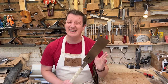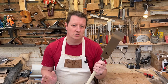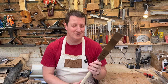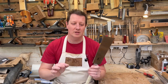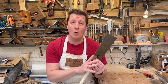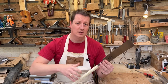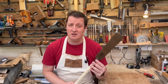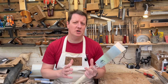It's not really a fair comparison to judge the rip cut against other saws, but the cross cut blade is a direct comparison to any of the Western saws I have — and I think I like it. The biggest thing that stands out straight away is that initial cut is so clean and simple. It's not teeth bouncing over the edge to get that first cut in, which seems to happen a lot with Western saws. This just seems to want to cut and wants to start. Yes, you can definitely put too much pressure on and it will bend at the joint, but I think that was my technique rather than a problem with the saw itself.